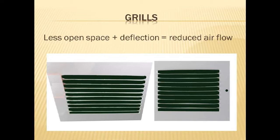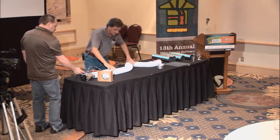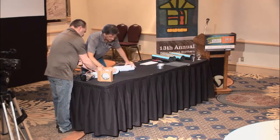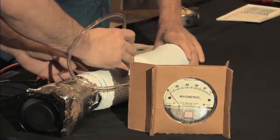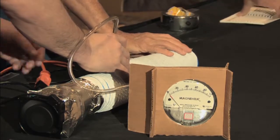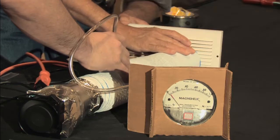The same gadget, bent straight, gives me almost twice as much airflow as the one that has the angle on it. And that becomes more and more important as we're moving on. We're going to see a bit of that in just a minute in terms of new arrangements we're starting to make with heat recovery ventilators and where we position them. But we will be moving more and more to open, straight vents as opposed to these ones.